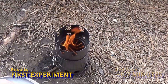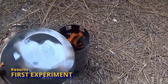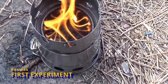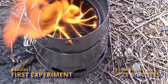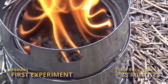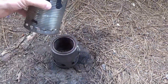The overall burn time was about 22 and a half to 23 minutes. You can see the flame was nice. The pot did have some tar buildup on the bottom, which is not good — we'll work on that with the next experiment. But you can see we're getting nice powerful jets now, much more powerful than before. The flame still does flicker, so we have a few issues to take care of. That pot stand didn't seem to add a whole bunch to the flame.